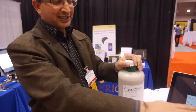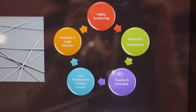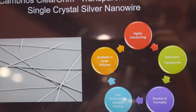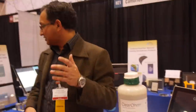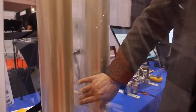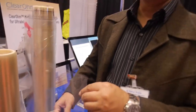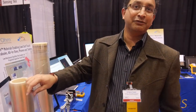So you can get these very thin nanowires that give you very high flexibility and highly conductive and transparent networks. It's conductive, transparent, and flexible. And it's also usable at very low temperatures, which allows us to coat these materials on plastic films. This is a film which, if you heat it to 150 degrees C, would start melting. But our material uses very low temperatures, and we can coat and make transparent electrodes on these films without impacting the film performance.